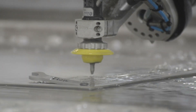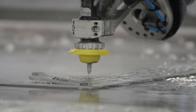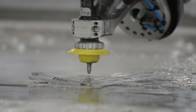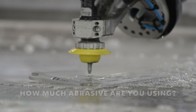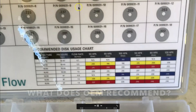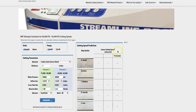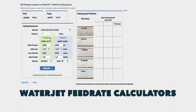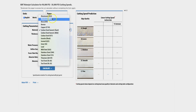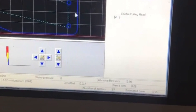All the above information is guidelines for customers to consider and balance against their individual goals within their respective operations. We suggest customers consider: understand how much abrasive you are using — does it match your manufacturer's recommendations? Have you checked it against other industry calculators? And most importantly, does your flow rate match the input in your CNC?